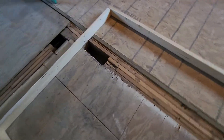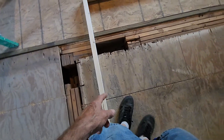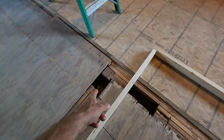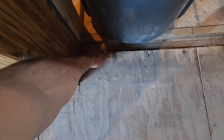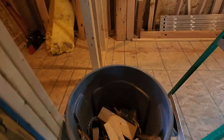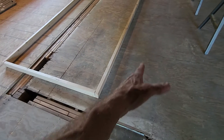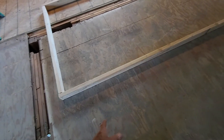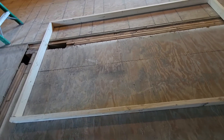Last night I got the heat runs for the first floor and second floor torn out and recut. The first floor one comes off over here and kicks out the toe kick of the island right at my window. The second floor one — they've got to crisscross each other, and that one heads over here. I chopped a hole last night — you can see it right there — for an oval to go through that triple 2x12. So I've got my first floor return, and rather than leave it in the floor since this is the overhang on two sides for chairs, I'm going to have to bring it down and cut through this rim joist and get it up into the toe kick.